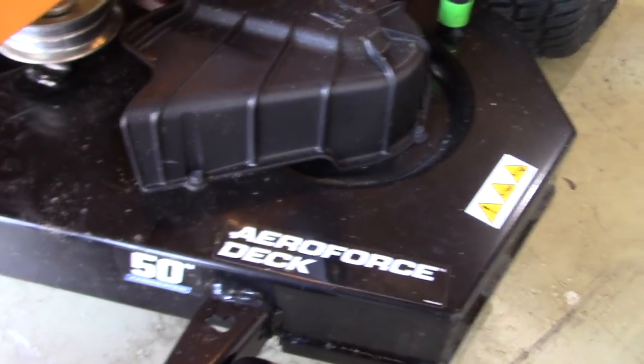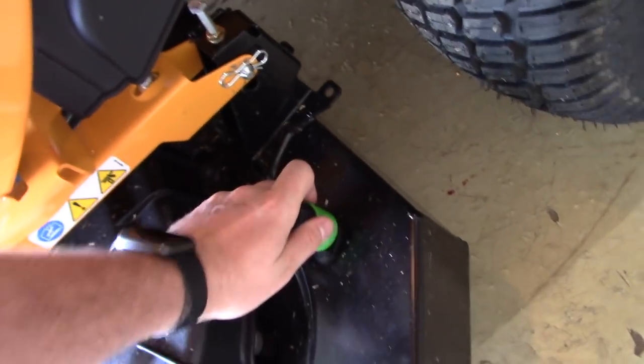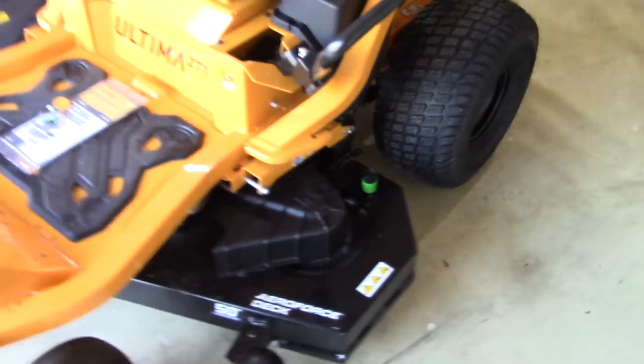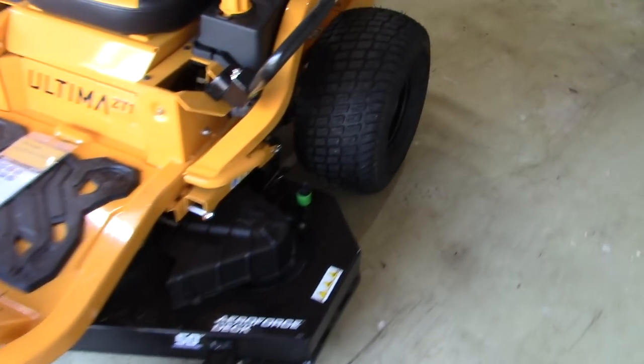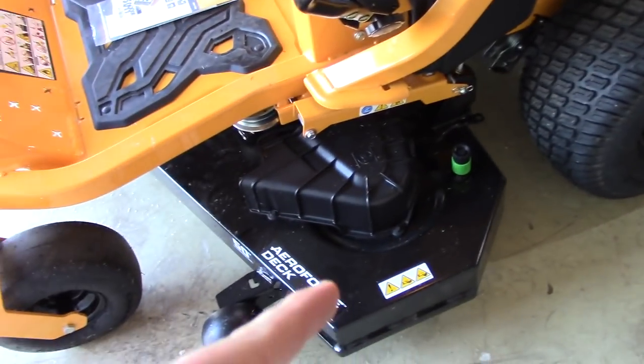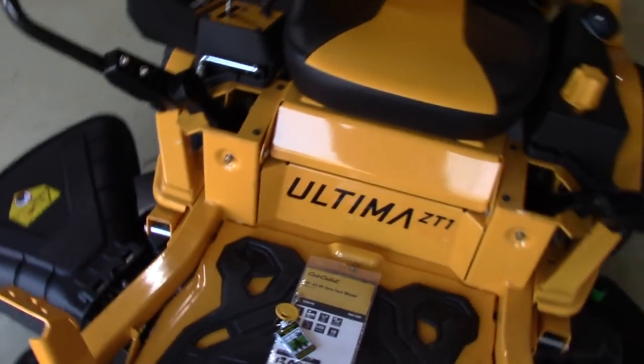The fabricated deck is welded as opposed to stamped, so it's a lot thicker. It also comes with a clean-out port — you attach it to your hose, snap it down, turn the water on, and engage the blades and it clears out the deck. Don't do like I did the first time: I didn't have the blades turning and thought it was a piece of crap. Turns out you need the blades engaged — it clears it out extremely quickly.